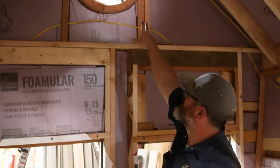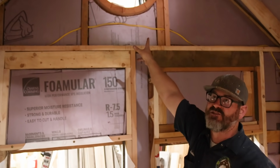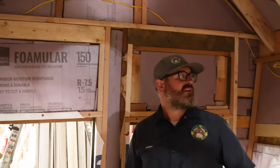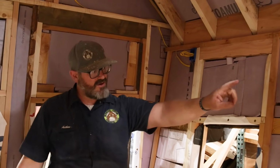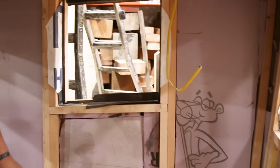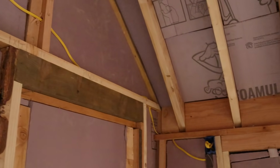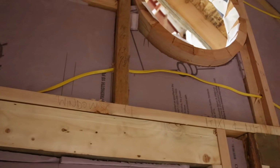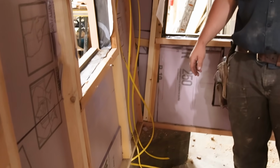And then as Rob was running that by Dave, he said, oh yeah, great. But can we do our smart home stuff in it? So it might get a little crazier than even what we're doing, but cans in the ceiling, lanterns out at the ridge beam that we want to put lights in as well. Maybe a light outside. We're going to have power above the loft here and power below the loft. And then we're also going to run all this over into an electrical panel down below here so we can access that here, and then down below we'll tie the power in.